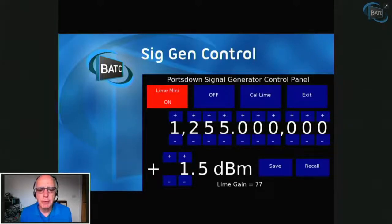It does not yet drive an external attenuator, but it gives you a rough indication in dBm of what the output power is. It also provides a note about what the Lime gain is. The DATV Express is another source it will use very successfully, covering up to 2.45 GHz, where the gain and output levels are pretty accurately calibrated because Charles and the team did a very good job with that board. So there is plenty of scope to use Portsdown as a signal generator.